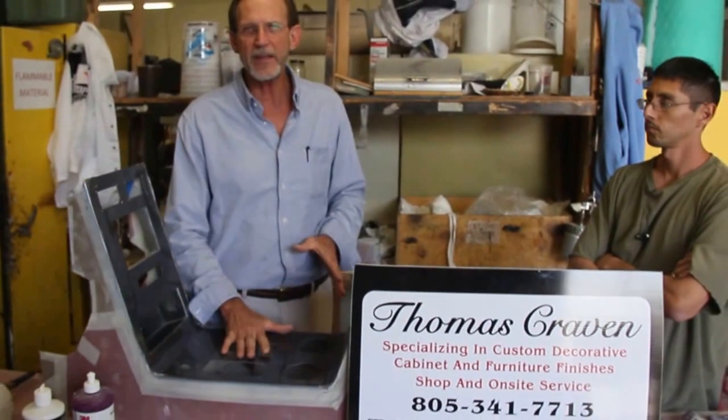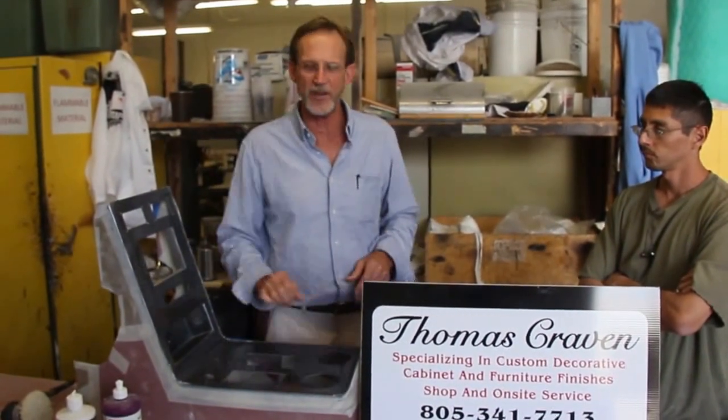And then what was the next? 600. 800. 1,000. 1,200. 1,500. To 2,000, with your final sanding. And all of that successive sanding is necessary to remove your sanding scratches that you put in with the previous sandpaper. So in other words, you can't start sanding with 2,000 grit if you've been sanding with 800. So the initial sanding is with 400, move to 600, 800, 1,200, and up to 2,000. You do that in succession so that you repeatedly remove your sanding scratches as you go.